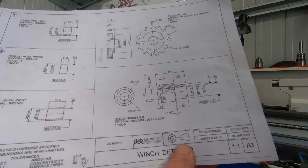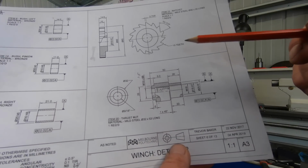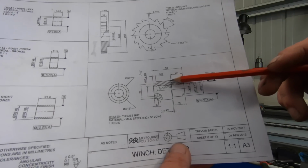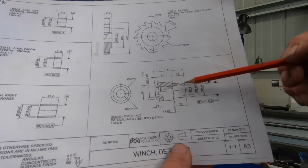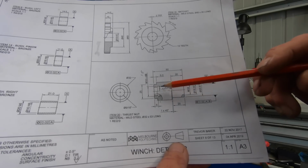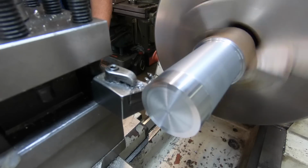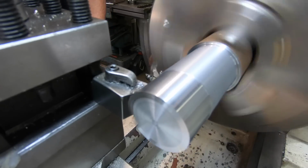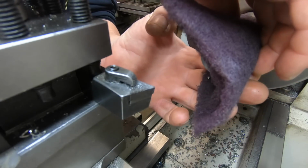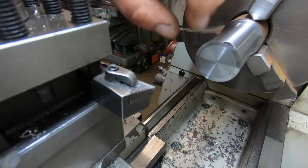So I've got a piece of scrap material in the lathe that I've just roughly got down. Still got another mil or so to take off the OD to bring it to 32, and I can put the steps in it and then start boring the guts out and doing the features on the inside. That little piece there will get taken out later.